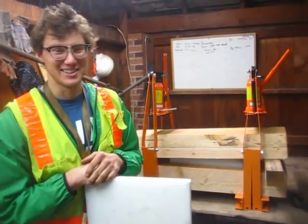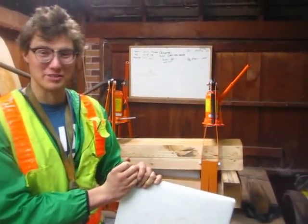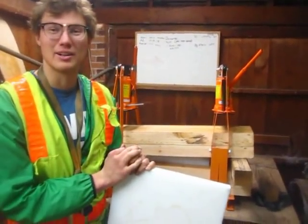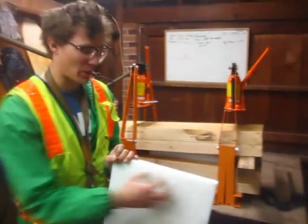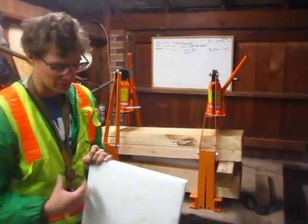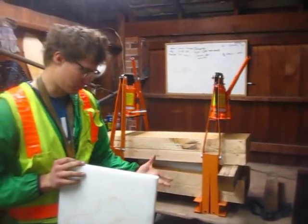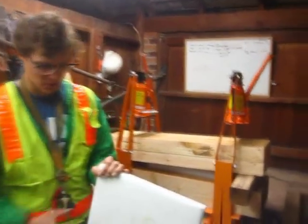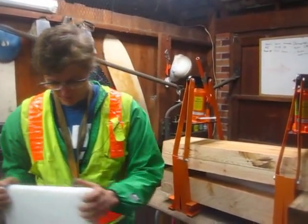We've designed the deck in computer world with computer-aided drafting. That's what CAD stands for. That's what's going to generate all of our cut paths so that we can cut that out of the plastic and then basically just drop it right into our mold and then lay in our layup schedule to press boards. And then clunk. So basically these are going to be the interchangeable slugs that will create the profile for the deck. Nice. Sweet.